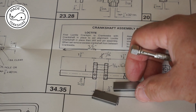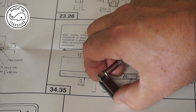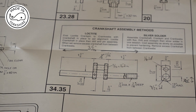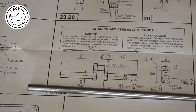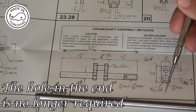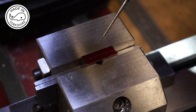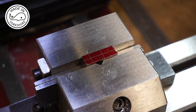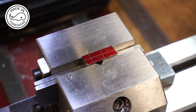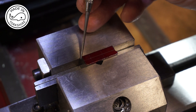I've cut the piece of steel bar in half that makes up the crank webs. I'll join those together with some Loctite 638, then face off one end and mark those up. The crankshaft needs to be 3 and 5/16 of an inch long, so I'll face up those ends to make that particular dimension. Both crank webs are now joined with Loctite 638. I've scribed a line down the centre and then scribed a line 7/32 from this first end.